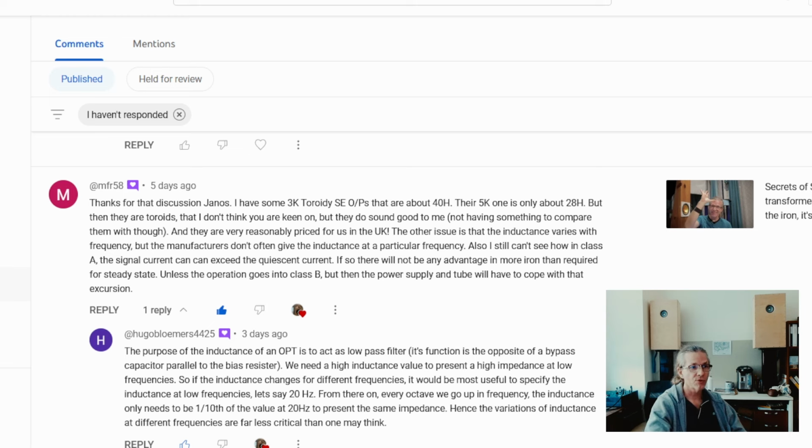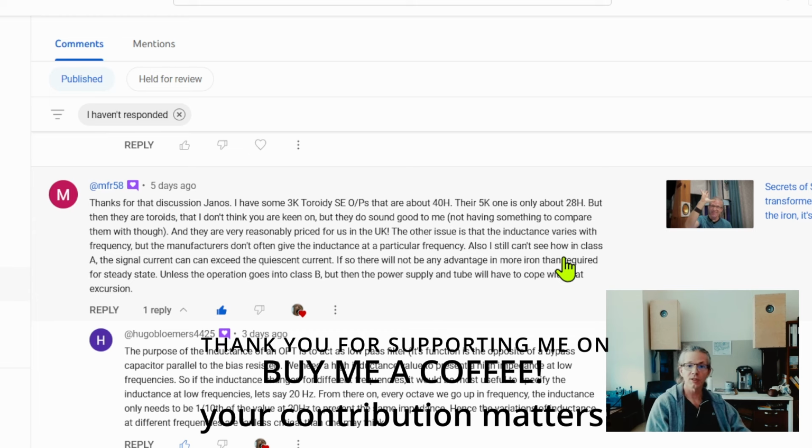So I'm going to go with comments that I received on this subject, and I will just continue and explore from here. MFR58 commented something really interesting about his experience with transformers. He says that he has 3K primary toroid single-ended output transformers that have 40 Henry specified inductance, and their 5K primary model is only specified at 28 Henrys.